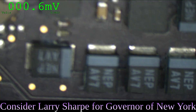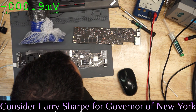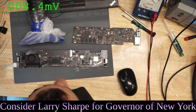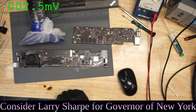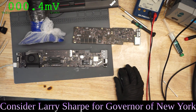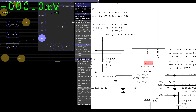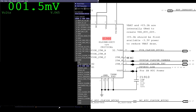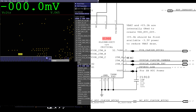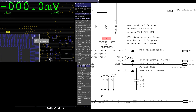The clock chip was causing our PM Sleep S4L to be missing. Now we have a spinning fan. The clock chip can actually cause PM Sleep S4L to be missing even if the RTC voltage is present. One of the things you may have noticed is that there was only half a pad right down here. Pin 12 is for the PCH 32 kilohertz clock signal, and that goes to the PCH side of the CPU. You need your 32 kilohertz clock — if you don't have it, it won't work. So I should go back to some of the boards I said forget it to; maybe they have a bad clock chip.